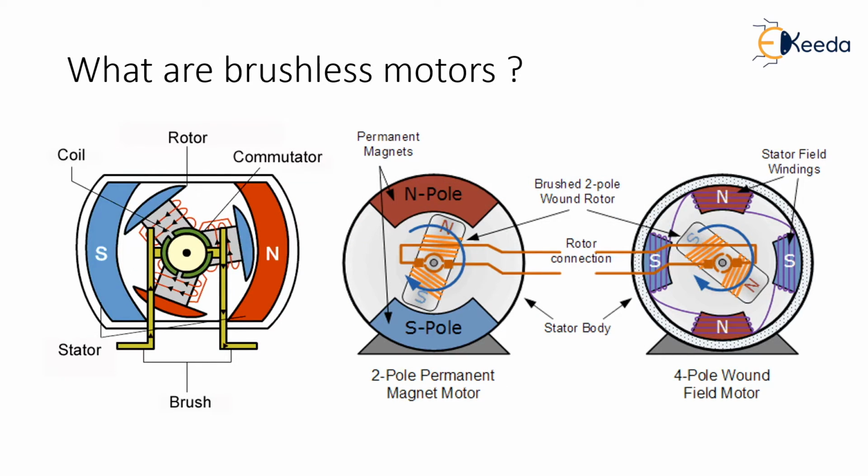As the name implies, a brushless drone motor lacks brushes. The brushless drone motor can be effectively divided into two separate components, the rotor and the stator. The stator is the central unit into which the rotor is mounted. The stator is made up of a network of radial electromagnets that alternatively power on and off to produce a temporary magnetic field when a current is passed through the windings.